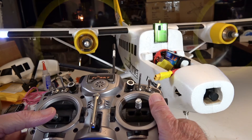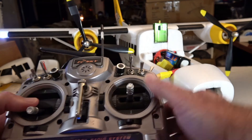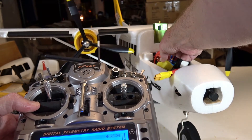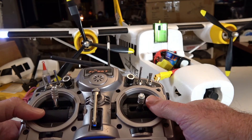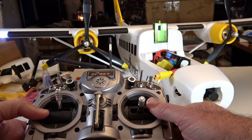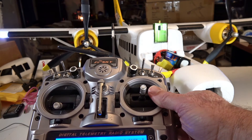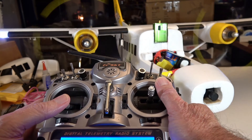See that? Now let's say we want to turn the brake off — same thing. We'll turn off the plane, move the throttle stick all the way up, and turn the plane back on. We'll let the first four sets of beeps go by, then go to the long-short beeps — here we are — and we're going to pull it down. Now the brake should be off again, and you can see it is.